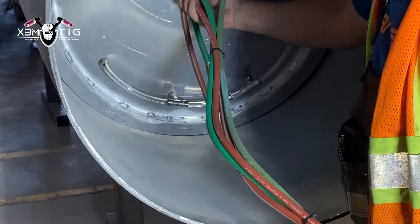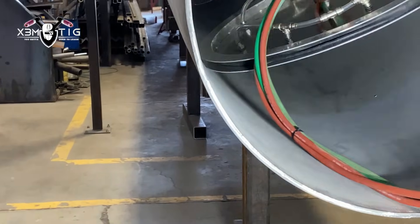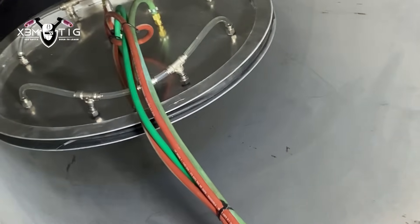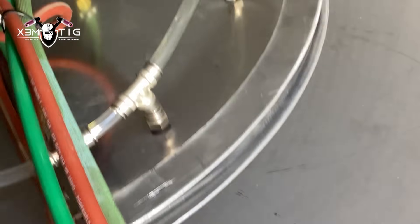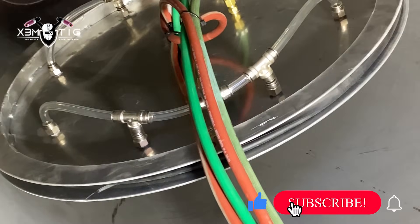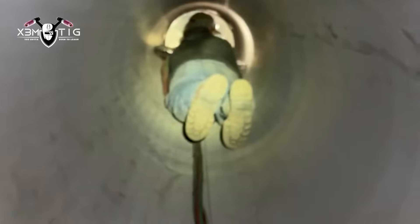This is the handmade purge plug we made out of aluminum. I got two hoses that fit the four holes — each hose purges argon inside. It looks like a bicycle rim — that's kind of the idea of the design. Right in the middle is an actual bicycle tube, and then we got little Schrader valves that inflate the plugs once installed. It's been put on a skateboard — a little bit easier to go in. Once set up on the marking spot, I connect to the air and the bicycle tube inflates and stays in place.